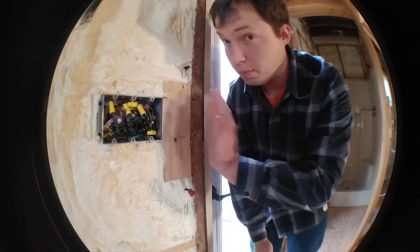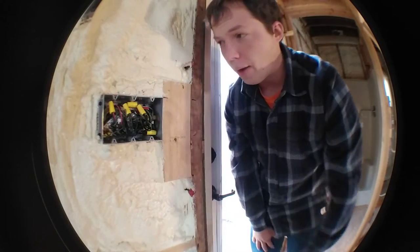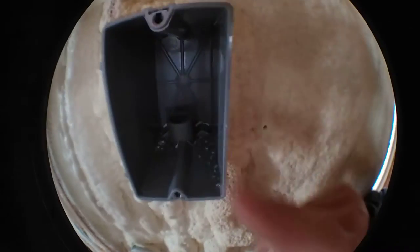Your spray foam installer should block off all of the electrical boxes. In my case, they took tape and taped across each box all the way around it, folding the tape over to keep a nice clean edge where the drywall will be going. There were a few they missed before they started spraying, but generally they should be doing that. If you anticipate doing home audio or any other wiring, you're going to want to have boxes pre-installed with conduit — I've got a piece of conduit that goes down to the basement from here, and also extra pieces going through the rim joist.